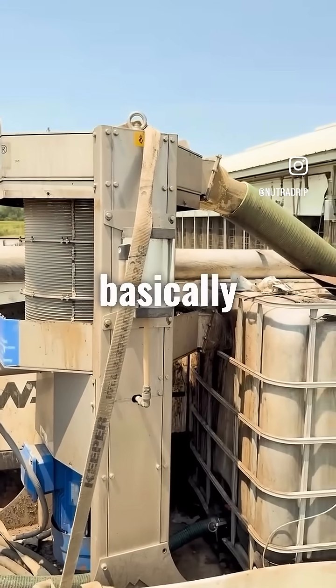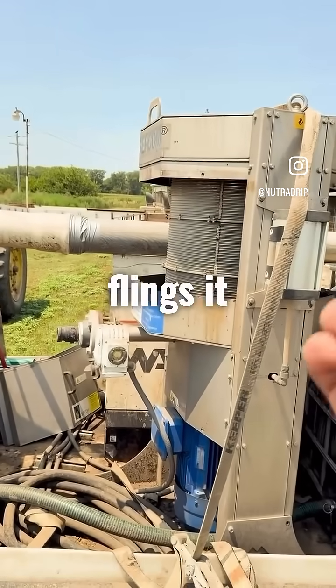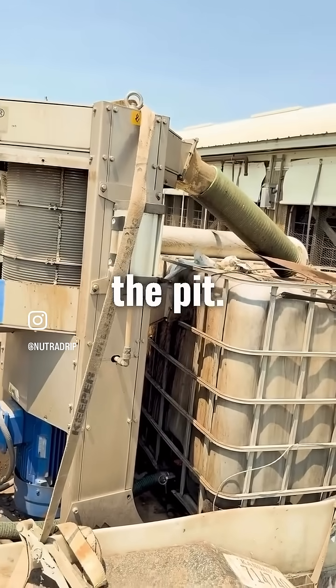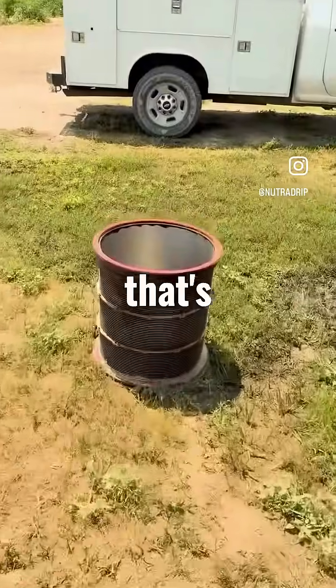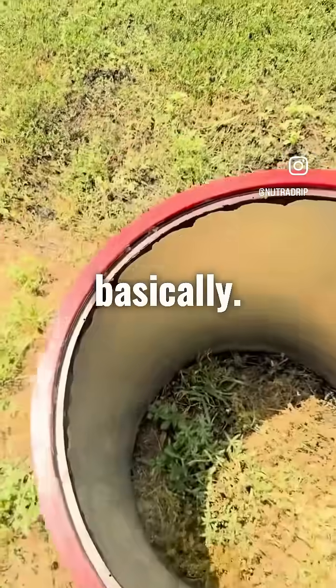That's how that concept works. Basically, the clean stuff drops. It's got a rotator inside there that flings it around, and the clean stuff comes out the screen. Dirty stuff goes up the top and out that top discharge, and that goes to the pit. The clean stuff just flows out of there into that tank when it can usually pump out of that tank. Here's what the screen looks like that's inside of that microfilter — it just spins in there, it's just a big basket, basically.